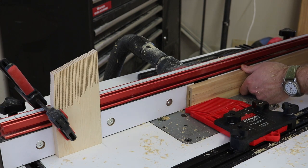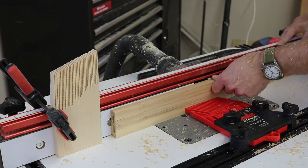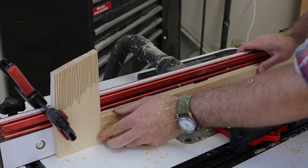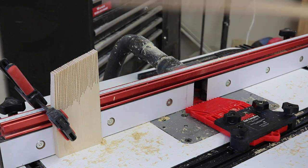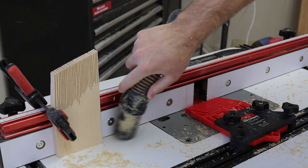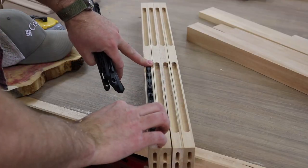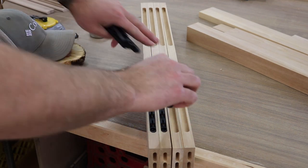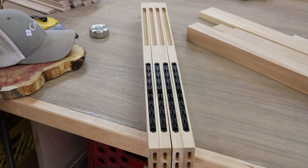The last step before glue up is to route out the mortises for the concealed panel connectors. Here, I use some careful layout and stop blocks on the router table to make sure all the mortises are as consistent as possible. I got these connectors from the wonderful Canadian company of Lee Valley, largely because they're the only things that I could find that would allow me to keep no visible hardware in the crib.